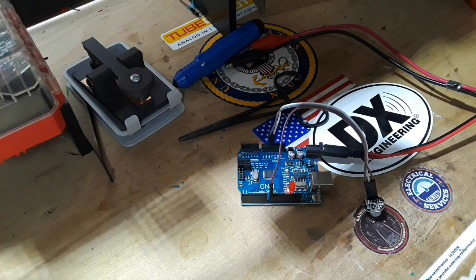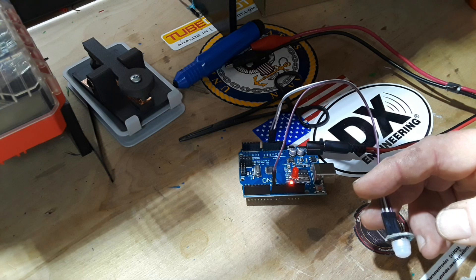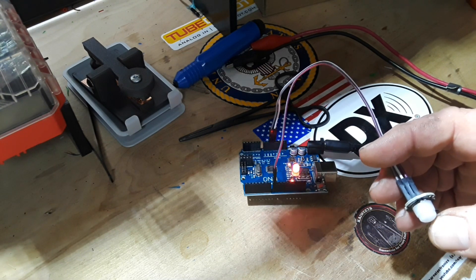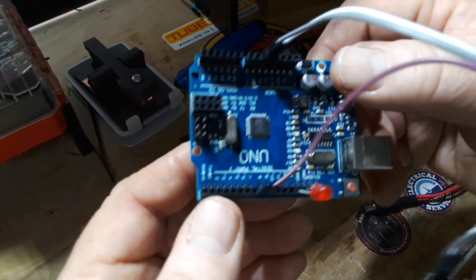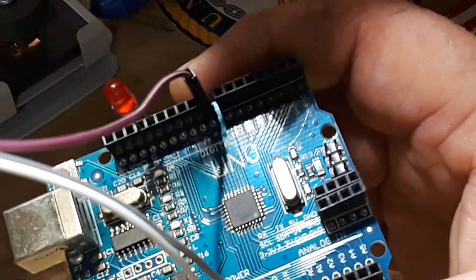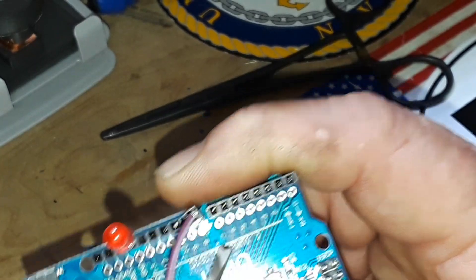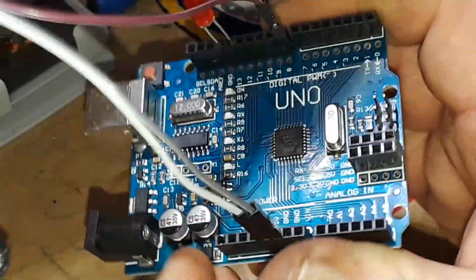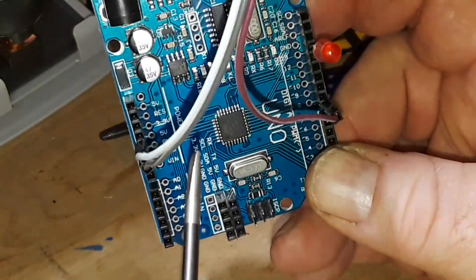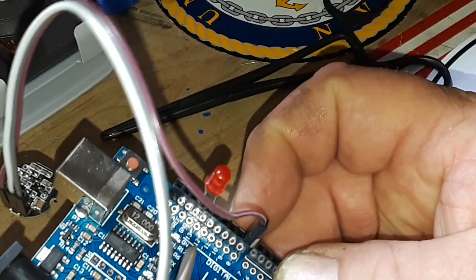Here's our final method using an Arduino Uno. There's our sensor and there is our detection. I'm going to unplug it so the LEDs don't blind you as you try and look at this. The trigger — the out pin from the sensor — is going to pin 8. It's getting its power from over here: 5 volt and ground. Then over here we have pin 13 and ground, which our LED is plugged into.